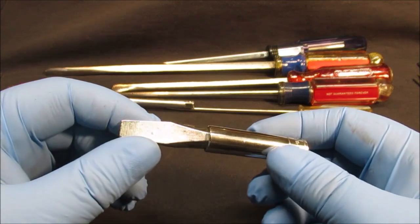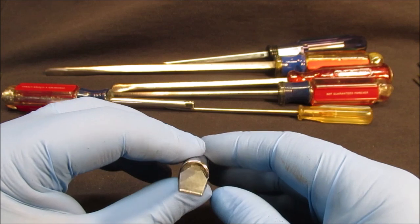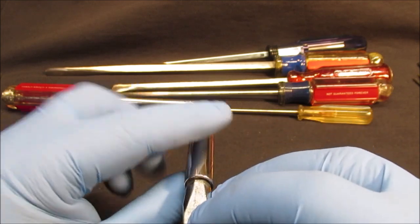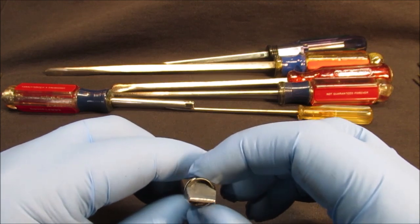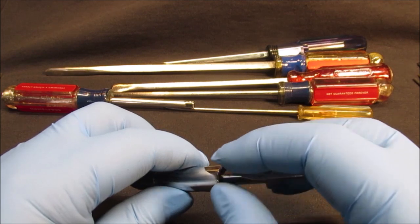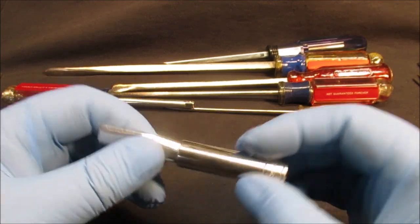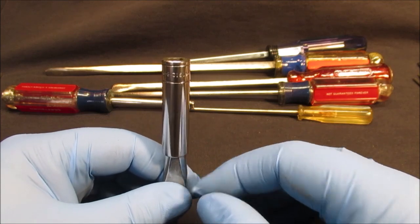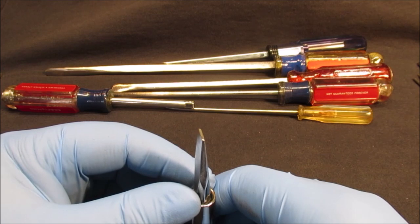This is that cut-off tip when I did my screwdriver challenge. And what I did was, I just kept grinding the flat part. You know, your socket is 6-sided. I kept grinding here and here and made this a little wider. And then here I ground more of a groove with the Dremel. So it's kind of self-explanatory. Then JB Weld, put it in a vise like this so it would run down. So it's kind of a nice handy tool there.